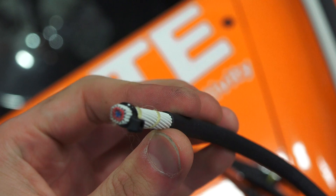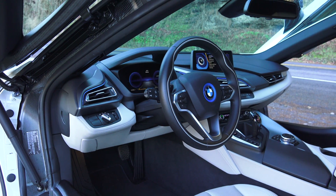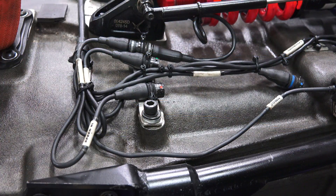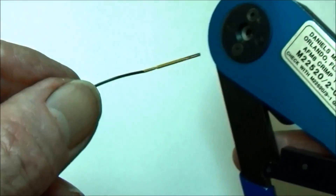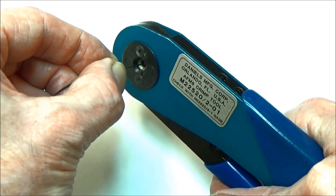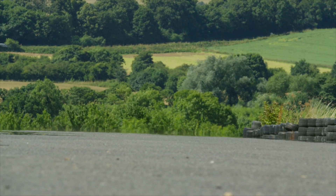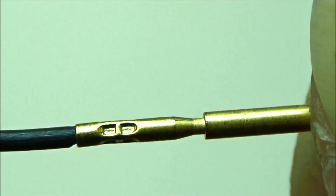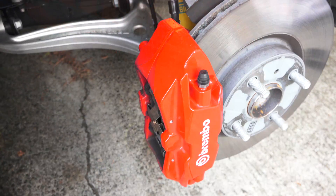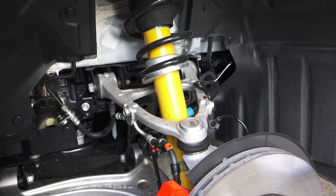So why isn't the technology as common in racing? The tricky thing about aluminum is that it requires a slightly wider cable to match the performance or voltage drop of a copper wire. This is part of the reason why it's difficult to have a significant bend radius with aluminum wires, making it ideal for long straight paths such as those in road cars versus the short small-radius bends found in race cars. Another challenge with aluminum is called cold creep — when a connector is crimped to an aluminum wire, over time the aluminum relaxes, meaning the physical connection is not as strong even though it will still pass a current. In racing, where suspensions are super stiff and vibrations are very high, these aluminum connections won't have the reliability that copper can offer. Aluminum has been tested in Formula One for the weight savings, but copper has been found to be much easier to work with along with the added reliability. On road cars, where comfort plays a much larger role in suspension design and the cars aren't driven at nearly the level of race cars, aluminum can handle the vibrations just fine.